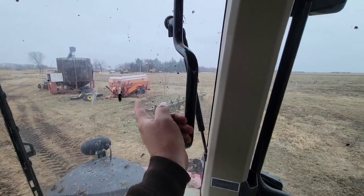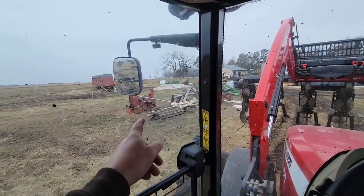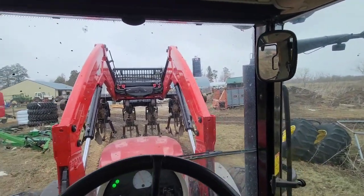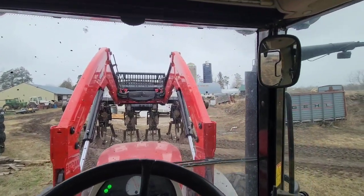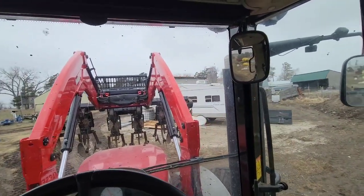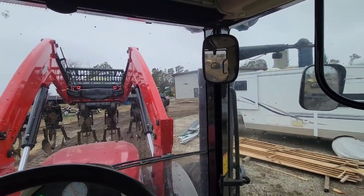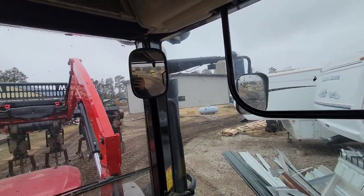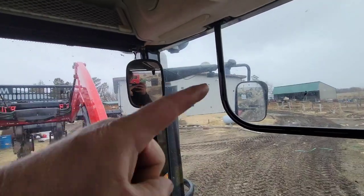So I got several people looking at the TMR, believe it or not, but the old Gale blower. If anybody's still filling silo, that's a 1,000 RPM blower. It's like a 36-inch paddle in there. I'll tell you what, that sucker would blow up that harvester, that 80 feet or 85 feet by the time you got to the gooseneck. I'd put the 4640 or the 5020 or 4020, whoever was available that day, on the blower when we did chopping. And oh man, you could unload a wagon with the 4640 on that blower. It took you longer to hook the PTO shaft up. Now, I'm not just trying to sell something here, but that blower blew so hard we had to fasten the gooseneck to the top of the silo so it didn't straighten it out.